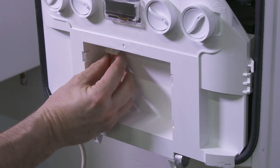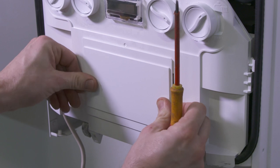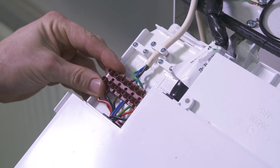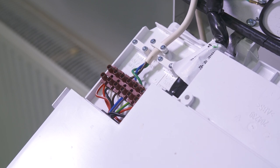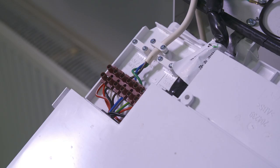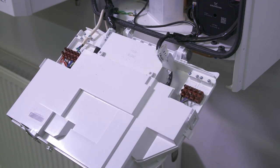Replace the link plug in the connector in the aperture. Swing the control box into the servicing position and locate the wiring terminals within the control box. The 230V connections are on the left and low voltage open therm connections are on the right. Remove any link wires or existing controls located in the room stat or timer plug, then wire the smart interface bracket into the open therm connections.